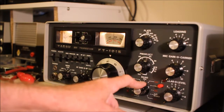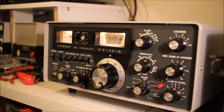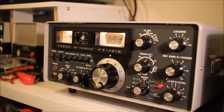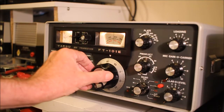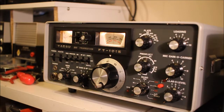One of the crystals I calculated was for 30 to 30.5 MHz — just off the top of 10 metres. There's also another box of crystals that came with it and they're all weird frequencies, which might explain the previous owner's lack of technical expertise in bringing this radio back. I brought it back and it looks nearly new and works really well. There's still a bit of alignment to do on the 10-metre crystal and top band also seems out of alignment. For some reason these LEDs don't work and I haven't quite worked out why — I'll have to take it apart again. But there we go — the FT-101E, and you're in business. Another restoration from G3ZPS — watch again, more to show you.